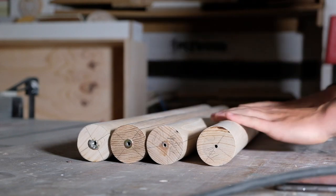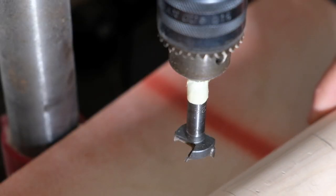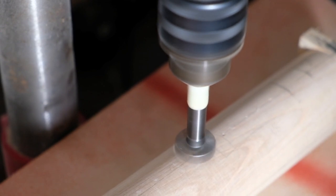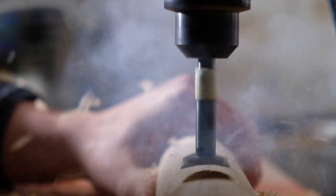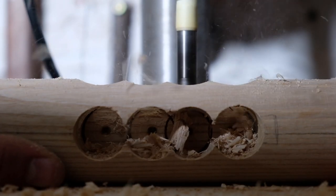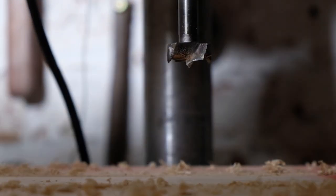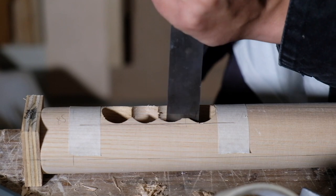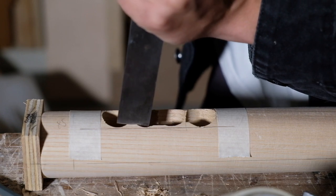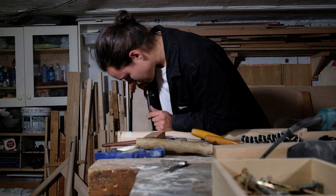To attach these two types of components together, I wanted a strong joint with lots of surface area, so I decided to use the mortise and tenon. However, the difficulty with cylinders is that there is no flat face to reference off, so I used the circle markings drawn earlier to draw four lines along the length of the leg that I could reference when removing the bulk of the mortise material by drilling holes over at the pillar drill, before cleaning these holes up with a variety of different sized chisels.